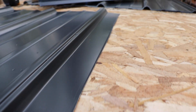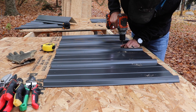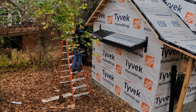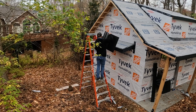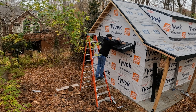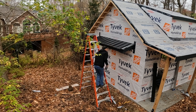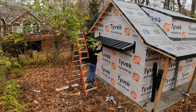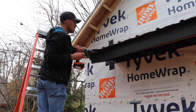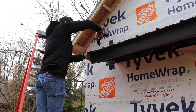Taking your time to lay out and even pre-drill your mounting holes is just one small detail that'll separate a great-looking roof with straight fastener lines from a not-so-great-looking roof. Based on what I've gathered, there are a couple of key ingredients to a metal roof: first, the panels themselves, but those are sealed at the ends with closures, which are foam pieces cut to the profile shape of the panels. The other side edges or joints between metal roof components are sealed with butyl tape. And then you have the various trim and flashing types to seal off, transition, or otherwise finish the roof. Getting all of those in place in the correct order are kind of table stakes for a successful metal roof installation.